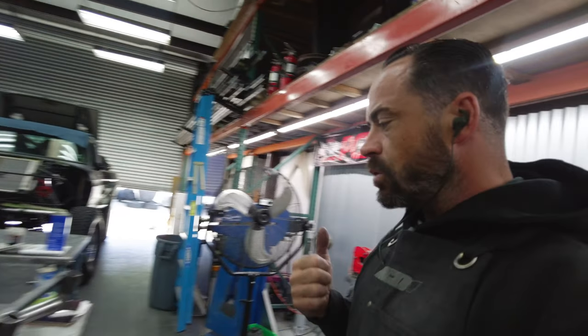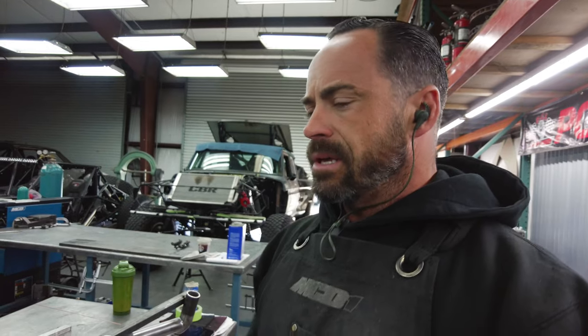Now on top of that, when you powder coat stuff, it's beautiful because it almost looks like a perfect continuous seam. You don't even see the upset. As cool as it is to see a bead in stacking, the end result looks jagged when it's finally coated with powder coat or paint. You see more upset than anything else. If you look at the ES Motorsports chassis, Porter chassis, Gordon chassis, a lot of that welding, some of the Everson chassis too, it's very tightly spaced. I've always looked up to that stuff, and that's what I value for a proper weld, rather than stacked, spaced out stuff.